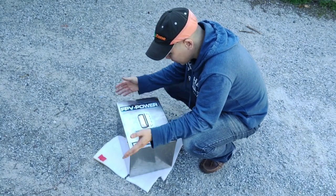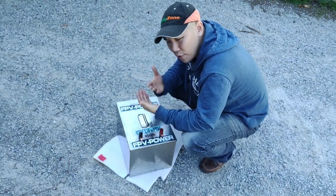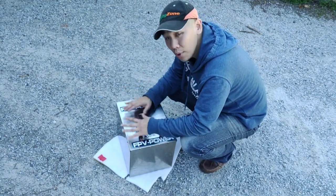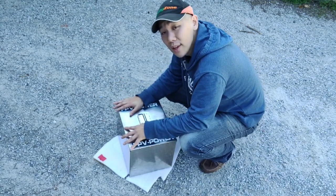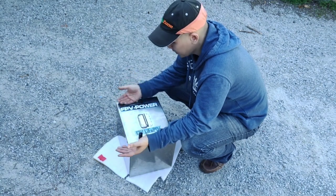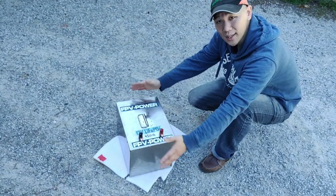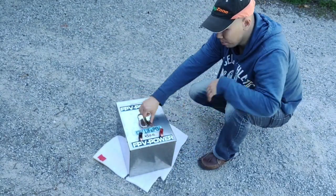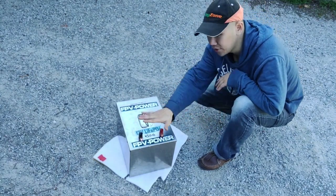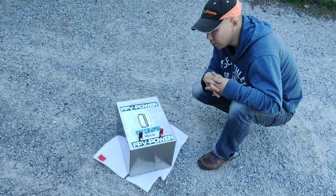And then after the discussion, I said, look, you're already using essentially 220, half of your 440. Now you've got a 450, which you can fully use. Don't just blow your money. Get one of these, and later on, if you find that you want to do more extended trips, put another one in next to it. I've got the specs. You can build another one exactly the same, custom built to fit the bay, and we just connect these two in parallel, and you've got 900 amp hour at 12 volts. So that is what we can do.